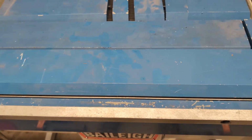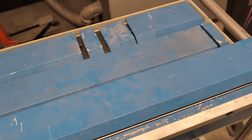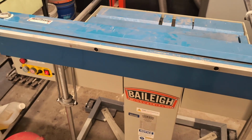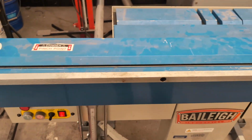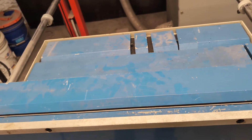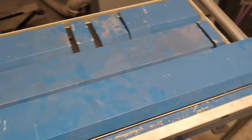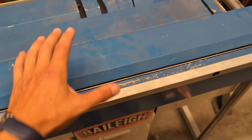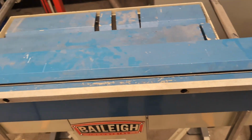2 is this uses a lot of electricity. So if you start to feel it getting hot, make sure to turn it off and let it cool down for a bit. You'll damage the magnets if you let it get too hot by running it for too long. And then last, try not to turn the magnet on without any material in there. The machine at that point will have a lot of electricity flowing through it to make that magnetic field holding this thing down without any distance between the bed and the finger. So bear those things in mind. Don't clamp without material in there, stop if it gets hot, and don't drop any of the metal pieces, including the leaf.